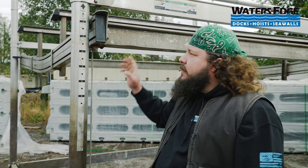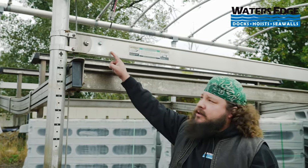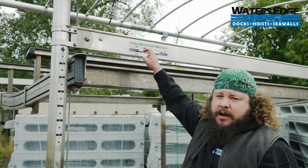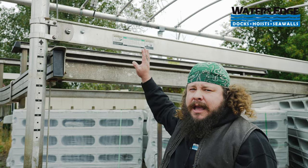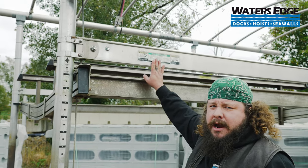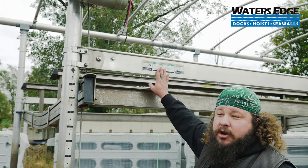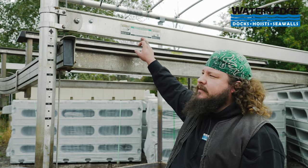Important to note: this particular lift is a short station lift with a winch tube. If there is an issue with the winch cable, it runs through this tube, through a snatch block, and all the way to the other side. If you're having a cable issue on this type of lift, this is going to be a several thousand dollar cable repair — definitely something you're going to want to use to negotiate or walk away altogether, because it's going to cost you some serious money to fix.